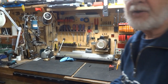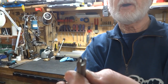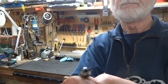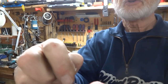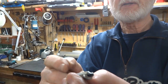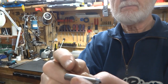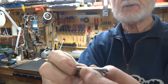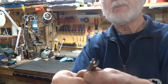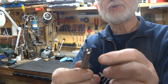Let's just take a look at what we've got so far. What we have to do now is first put some kind of a set screw in here so we're going to be able to hold that drill when it slides in. Then I may put a hex on the back so it doesn't slip, and we will of course have to heat treat it — we want it to be pretty hard down at this end where the cutting portion is.